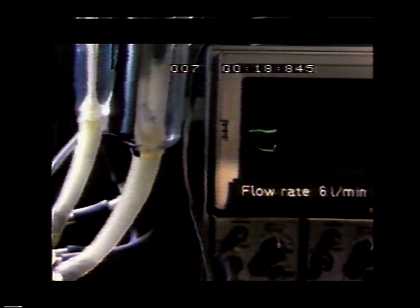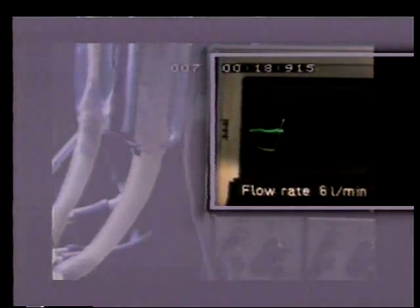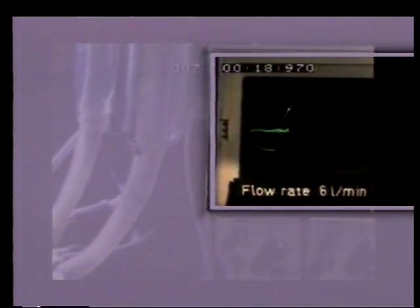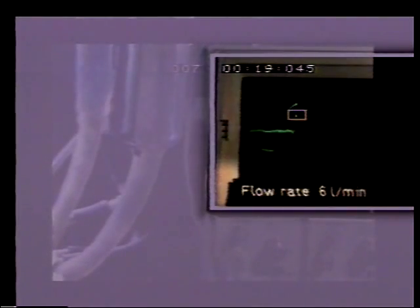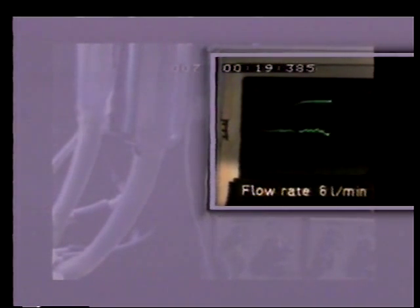The following diagrams show the pulsation curve and the vacuum level difference between the teat and in the claw. The short milk tube has an inner diameter of 8 millimeters. Note the high peak in the horizontal line, which means a high vacuum difference at the moment when the liner opens up into the milking phase. The vacuum under the teat end at that point is higher than in the milk claw, and milk residuals are sucked back. This peak was caused by the presence of milk in the short milk tube.